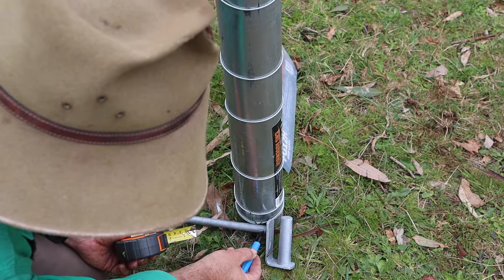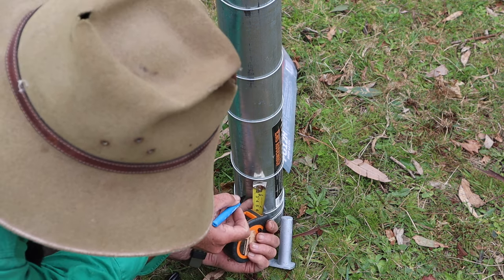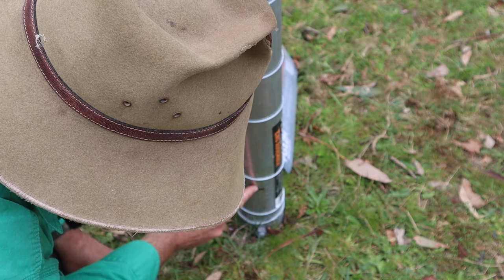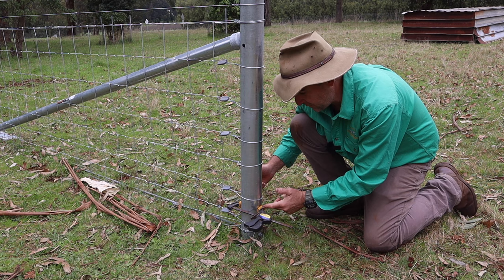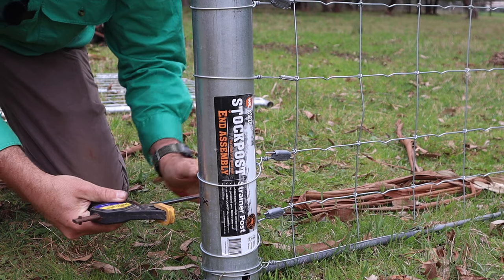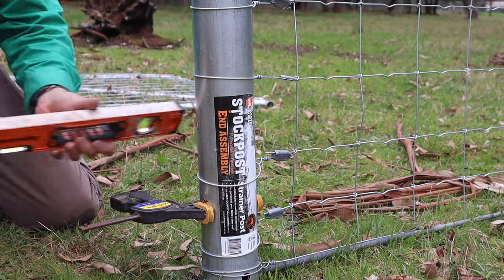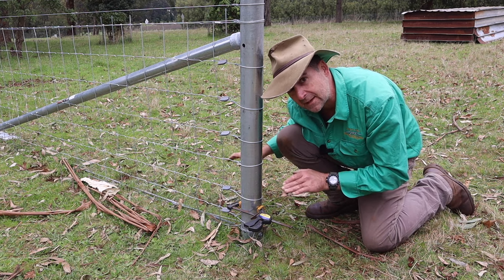To allow for the top of the plate I'm going to come down 25mm to the centre of the threaded rod from the top wire, and I'm going to make sure that my mark lines up straight up and down with the bottom brace. You will have to drill two holes front and back of the steel post of course. If you're worried about getting these two holes lined up, just use a clamp with a level and you'll be able to get your holes perfectly lined up with no droop or sag.